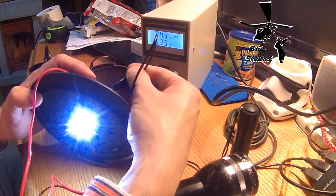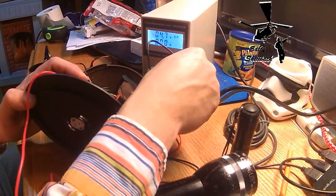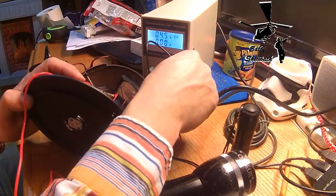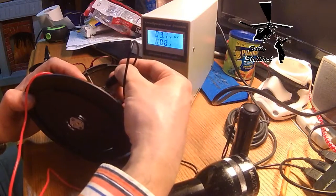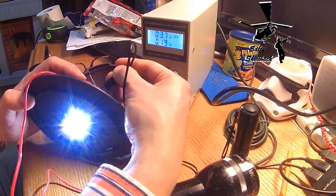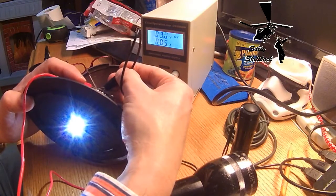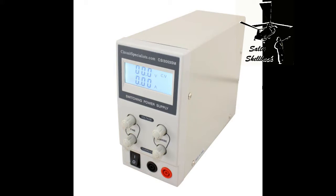5 would be pushing it, but yeah, that's pretty bright. So you could probably put like a 6-volt battery. Now a 5-volt battery if one exists. Since this is already broke, let's see if I can take it to 5. 4.7. Let's see what happens at 4.7. Ooh, that's pretty bright. Wow, it jumps up to 0.4 amps. Yeah, it's screaming. So now I probably stay with around a 3.5 volt battery. Yeah, it's pulling about 0.17. It's interesting, the more voltage, just a little bit more voltage, bumps it by, doubles the current. So anyway, that has to do with Ohm's law. V equals IR. But all right.